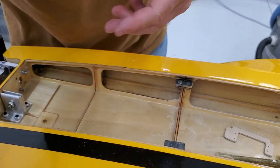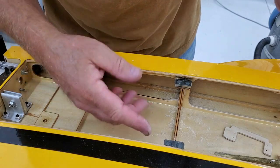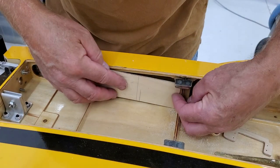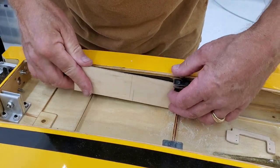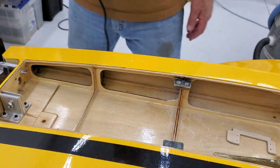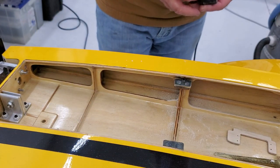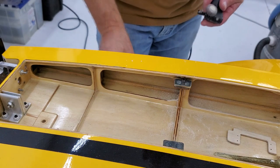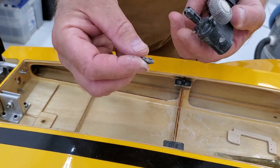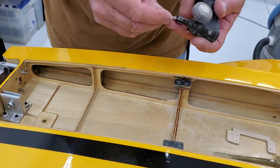Let me show you some of my favorite cutters and some of my least favorite cutters. Say you're working with something like this and you need to make a hole in solid material. You don't have room to get your drill in here, so you're going to use your angled cutter. This is a pretty typical burr — very gnarly. You're going to move material fast with this baby. That's what I want to do if I'm cutting a big hole.